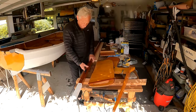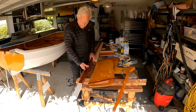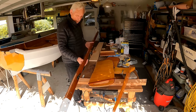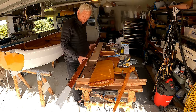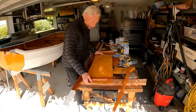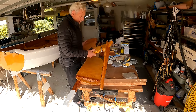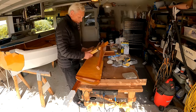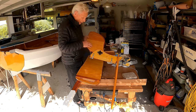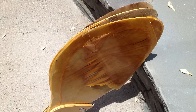The stuff for the dinghy sailing kit, I didn't buy it with a kit, and I just made it up myself out of found materials. This mast, eight feet of it, is made from laminated Home Depot redwood 2x4s. Works fine. The daggerboard is just that, made out of plywood, and the rudder I faked together using parts of the plans from Chesapeake Light Craft. Although I did make one error. I ran out of marine plywood for the rudder, and let's just say that didn't work too well. I had to remake it.